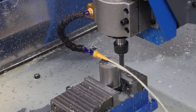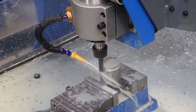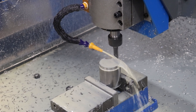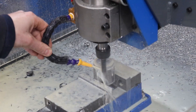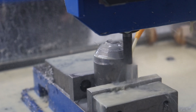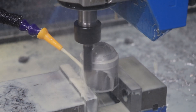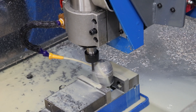Luckily we didn't open with any crashes, so aside from my feeds and speeds being way off, I thought we'd just let it rip. I've been running the spindle at full speed for all of these cuts just to get maximum power out of it and prevent stalls. Being unfamiliar with spindles and VFDs, I wasn't sure where the capabilities would line up with the demand on the power curve, so we kept it full throttle for all of these tests. This leads us to our second big discovery in faults on this machine — it became apparent that the spindle had considerable runout to the tune of almost three thousandths of an inch. It's not clear whether the spindle came this way or if the series of crashes caused it, as we never checked until we were trying to trace back the source of surface finish issues and chatter. Nonetheless, that is a significant amount of runout and is not good for neither the spindle, tools, nor the parts we were trying to create.